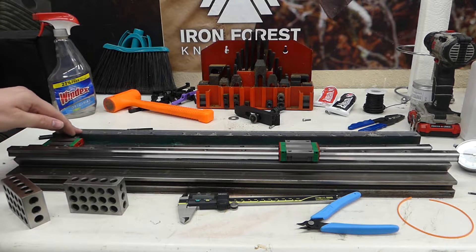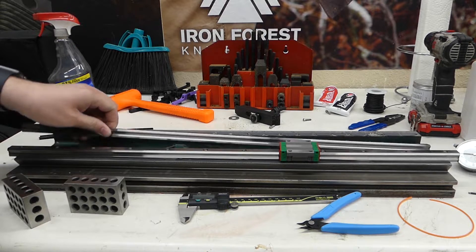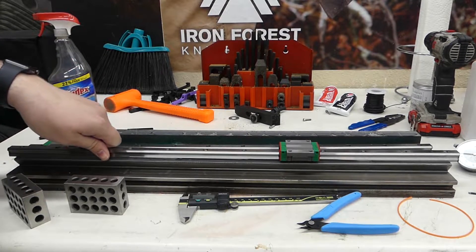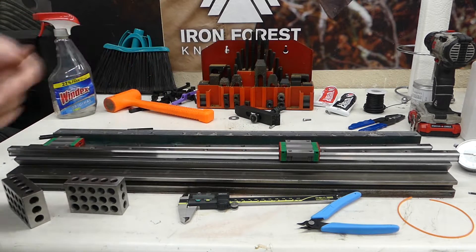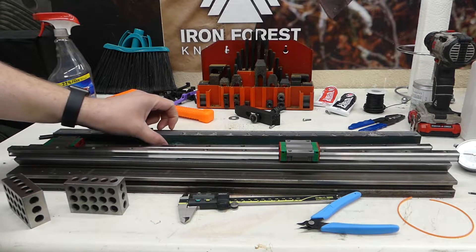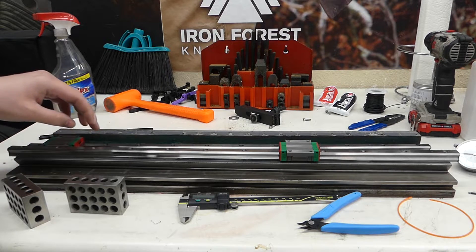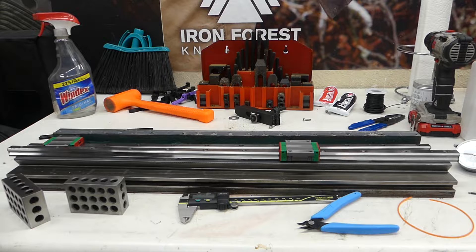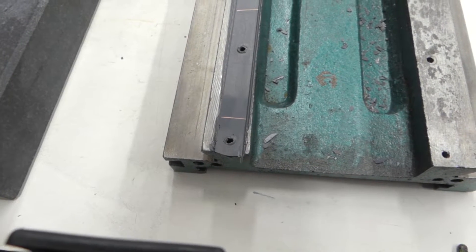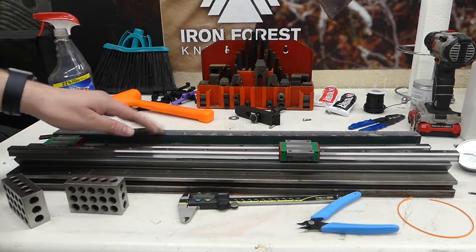What is up everybody? So I had a little bit of a problem. I mounted these rails with JB Weld and copper wire to get them straight and flat. But, you know how I'm unwilling to do things the right way — well, that bit me this time. Not surprised. When I put these on, I waxed the rails so I could get them off in case anything went wrong. And it did. This was straight and flat, but they are twisted.